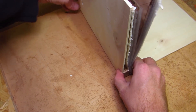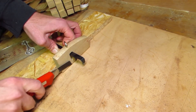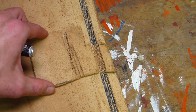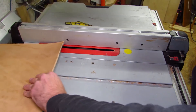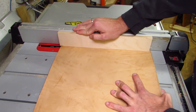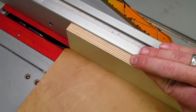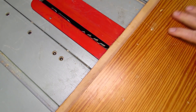There exists some footage suggesting that I used the proto-book to determine the size of the book's back — apparently I did that several times in several different ways. It gets a little confusing and frankly I have no idea what I did. But I ended up marking all the marks redundantly using a felt-tipped marker, including those at the center to make the spine. While my miter saw has a feature for non-through cuts, I prefer the table saw for this. I kept rotating the piece, moving the fence a bit further once I had made cuts on all four sides at a particular setting. Then I move to the center, where I flip to eat away at the material from the marked edges. I use a larger piece to hold the leather down and push it along. I did stop before thinning the whole back through, because I realized that this way I would get a better spine with two bends and more stability.